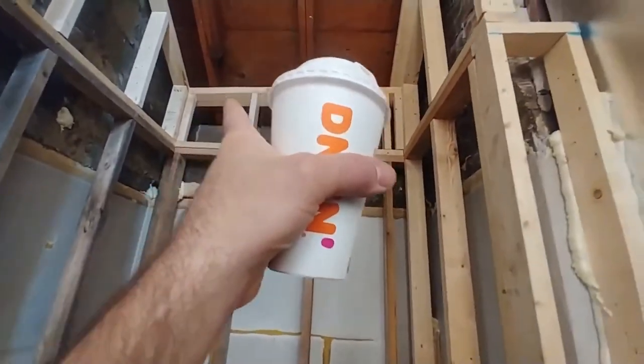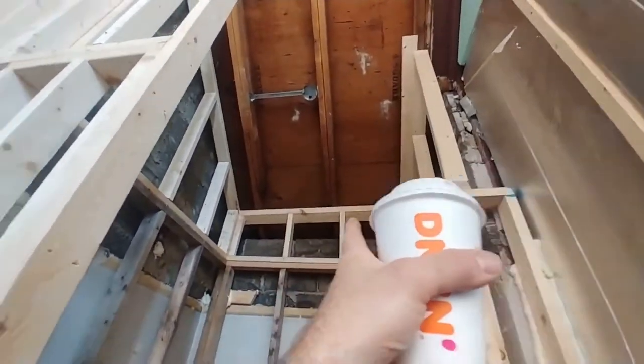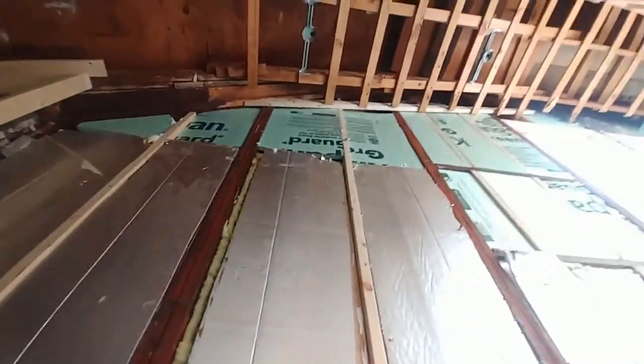And with how far out of square it was, touching the face of the surface here and off by over 2 inches there. Same here, sitting up from the wall as it's practically tight there. Caused us to have a weird inside corner that goes uphill on the right over here. I may plane this piece of the roof down so that it's a level line across there. This confluence of fuckery here is a real situation.